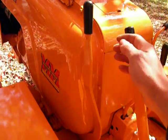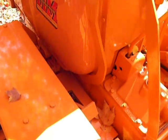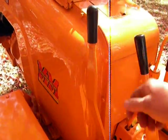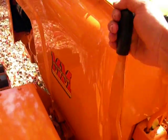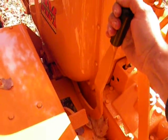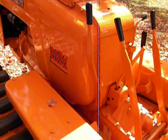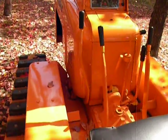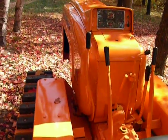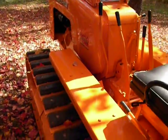Here's the main clutch. It's basically the same clutch as you'd find in a production 445 tractor — they just took the foot pedal off and made this handle so it springs back to the engaged position. To disengage it you have to hold it back; you let it go, it springs back engaged. Not my favorite type of clutch unit for a crawler, but it's prototype — it was never meant to enter production. They just put it together quick to kind of show everybody about what size of machine they'd be planning on making.